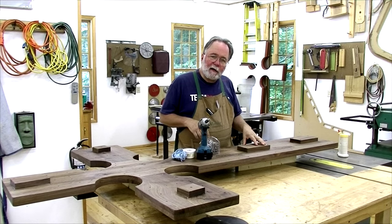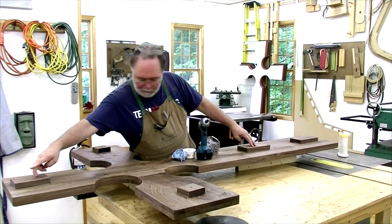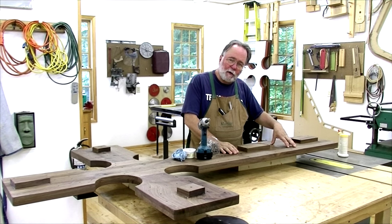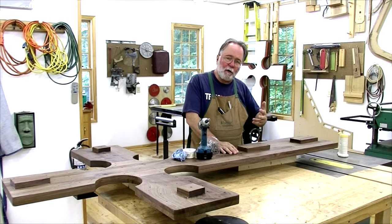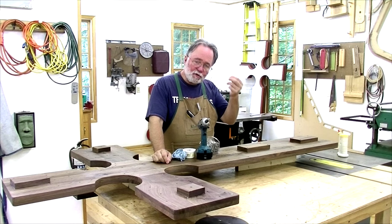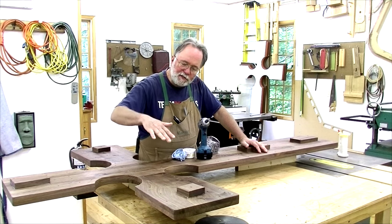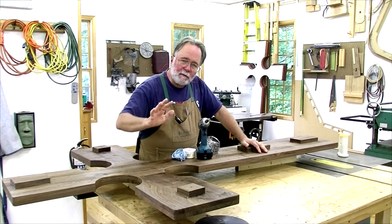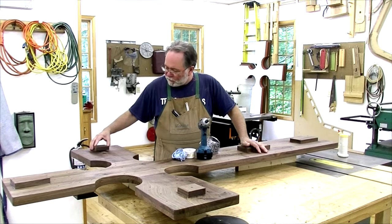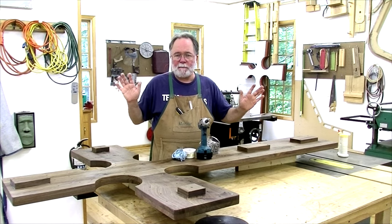The cross is going to hang on the wall of the church with three half-inch studs that come into pillow blocks. These pillow blocks keep the back of the walnut cross one inch off the wall so there'll be some shadow behind it. I'm attaching these pillow blocks with heavy screws and glue, and putting a pillow block on each end — these won't have bolts through them, they'll simply ensure the cross stays parallel to the wall.